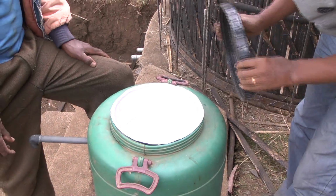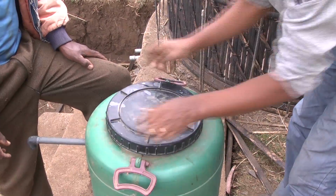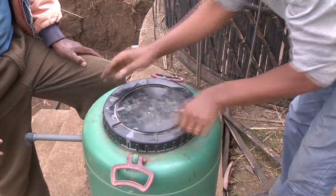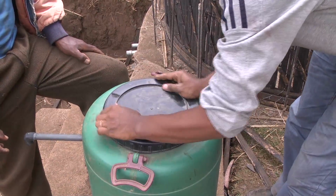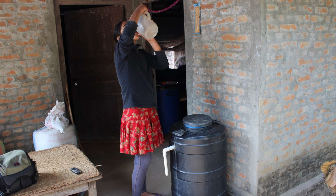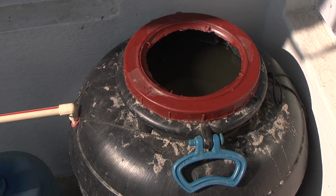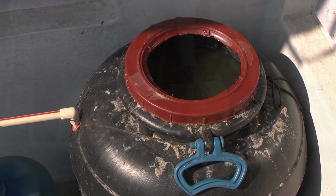When you start operating your filter, please take note of the following key maintenance issues. Firstly, make sure to cover the filter with a lid when you are not using it. Secondly, the filter should be used every day. A pause period of a minimum of 1 hour to 24 hours is allowed between each pouring. Thirdly, never let the top of the sand dry out and maintain a water layer covering of 5 cm depth.